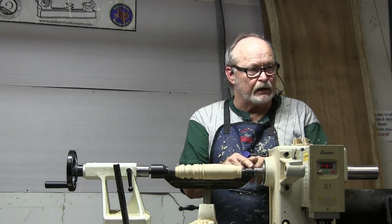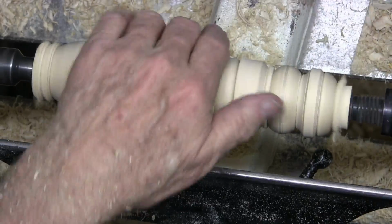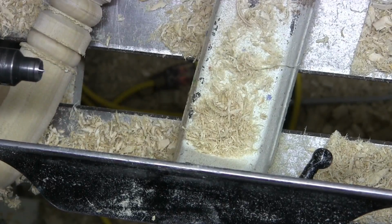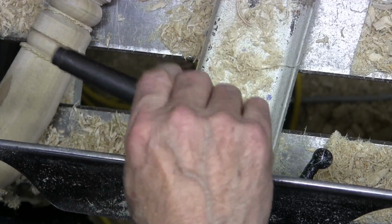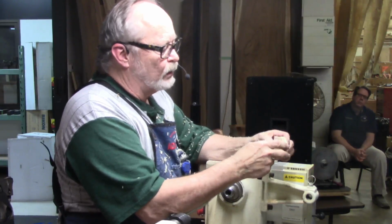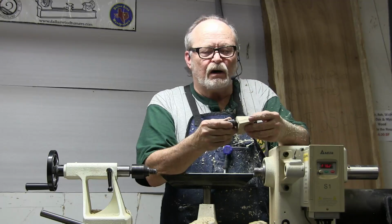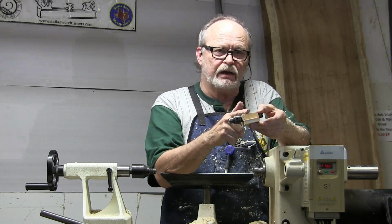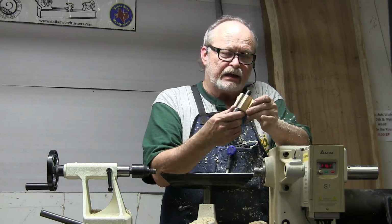So put in your center, put a mark on it where it bottoms out. Take that center, piece of plywood is best. Put one vertical, have an edge where it's flush with the edge. Now take this, hang it off, put it right at the edge, now glue in your other piece. Like that. Now you've just made a jig for your lathe, where it's going to bottom out on your lathe. Okay? And use that as a test.